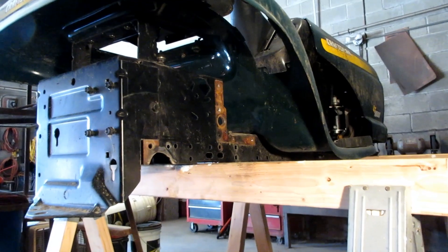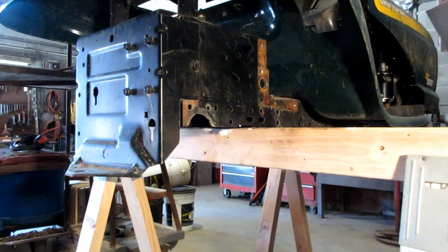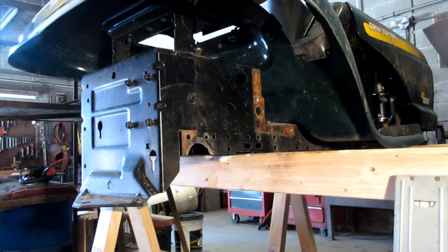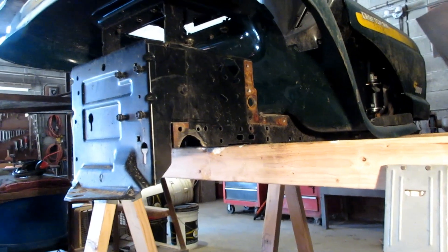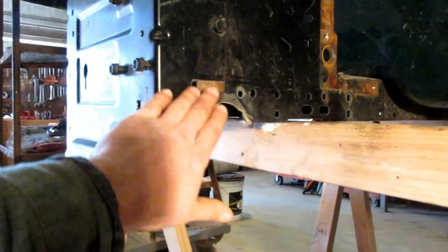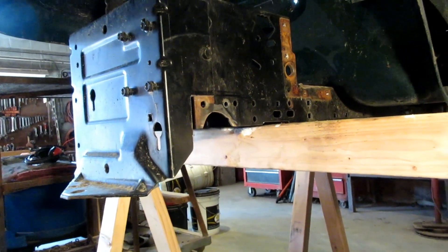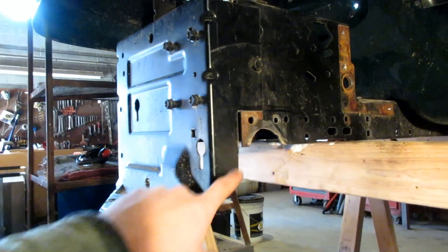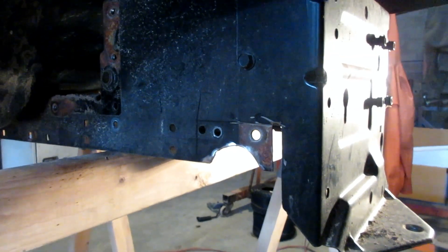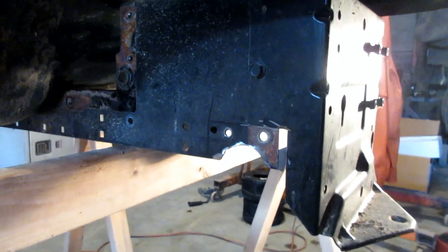It's now actually the next day and I'm back here. I fit the bearing plates on both sides of the chassis. This morning I just came in and removed the rest of the shifter - it was kind of in the way, I don't really need it anymore. I'm just going to check my measurements, check fitment, and clean up the outside edge of where I have to weld and start welding. Here's a view of the other side - same thing. I used the old axle mount and traced it out and cut the same hole.